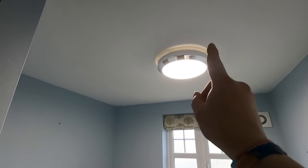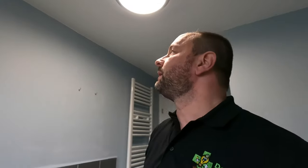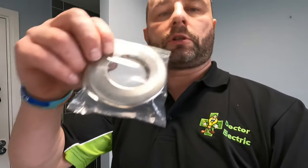And we're putting downlights, going to put one middle of the shower, one in there, and then over here above the bath, gonna have four. One, two, three, four. We did think about just having four in total, but the length of the room, sorry, it's just a little bit too long, so we're gonna have six. We're going with our trusted old Collingwood H2s, love them, and brushed chrome bezel.